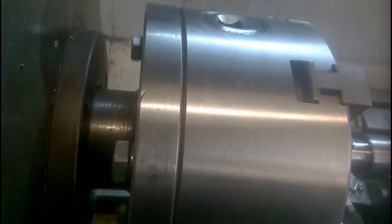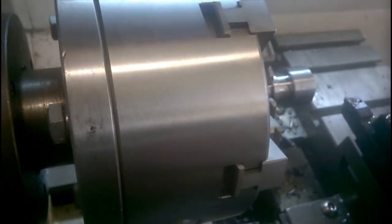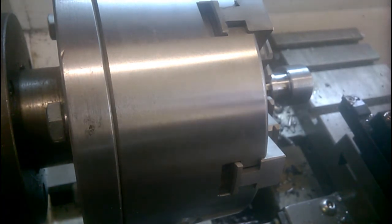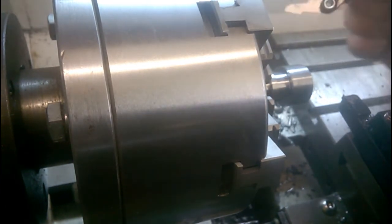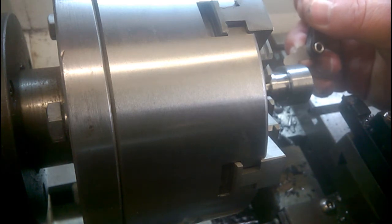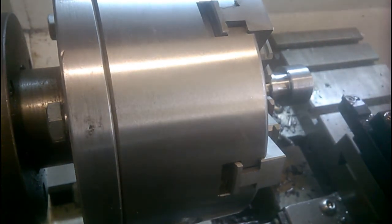I will try to get a picture of it, but I'm not very hopeful with this camera. And it is just a very light scratch pass, but putting the gauge on there, it does engage with the scratch pass and tells me it is 1 millimeter pitch. So I'll reposition the camera and we'll press on with cutting the thread.